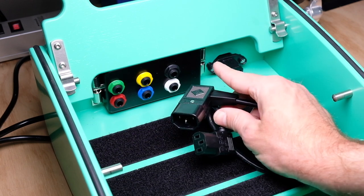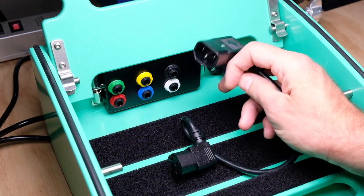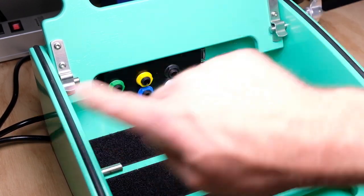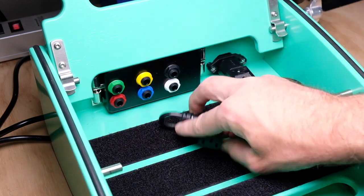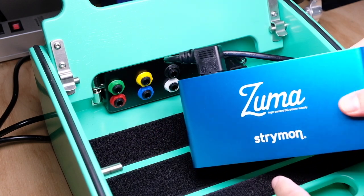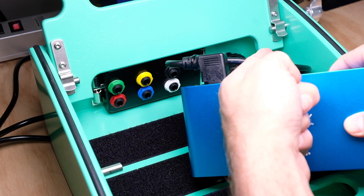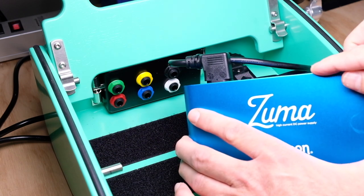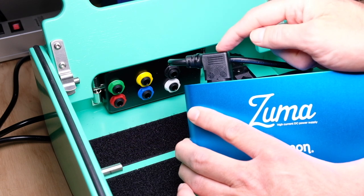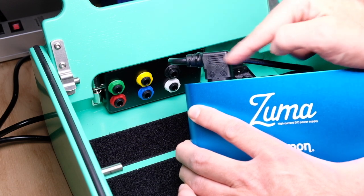Of course, it is going to be a bit long and you usually can't get them shorter than three feet, so you'll have a little extra cable. Now, this particular board only has one spot where you can do the power. On the longer Schmidt Array boards I think they actually have two, so you can choose which side you want the power on. On the Zuma, the way the IEC jack is mounted, the cable wants to go the wrong direction, which means you have to loop it back around. What I've done before is take the top off the Voodoo Labs power supply, pull two bolts out, and flip that around. You can also buy IEC cables in either left or right orientation — I'll put links in the description — so instead of looping the cable back, it just comes out and right-angles in the correct direction. Those are less than $10 and very easy to get.